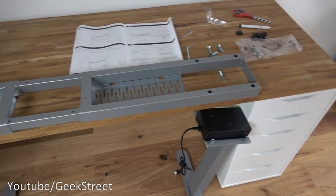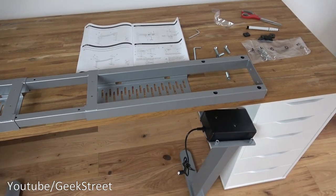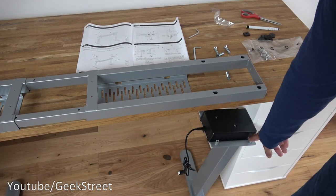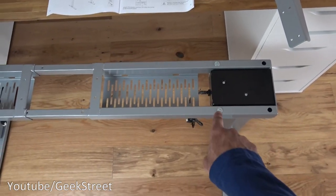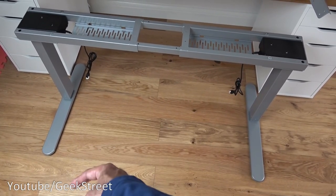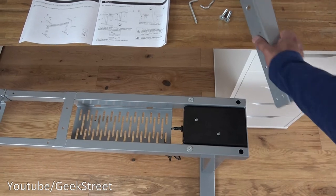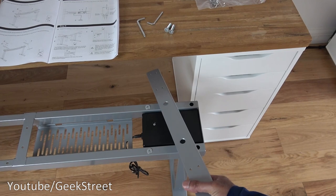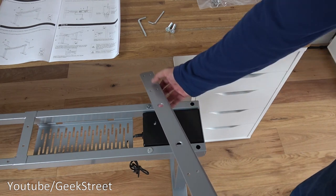Now I'm putting the supporting beam onto the legs. I've positioned both legs either side and adjusted the beam to roughly the size I need. I slot it into position — the support beam is now in place with two screws tightened on each side. The shorter end is at the back and the longer end at the front. The supporting plates sit on like so; note there are two screw holes on one side and three on the other, so you know which end goes to the back.